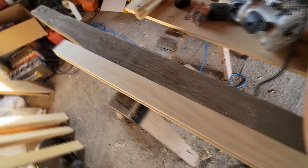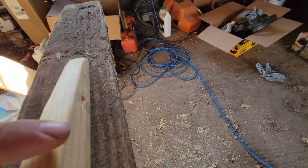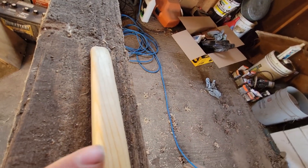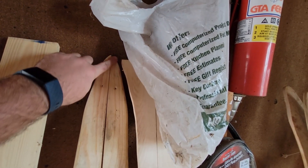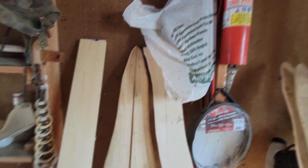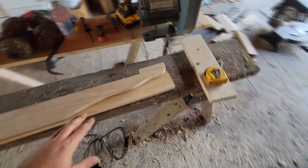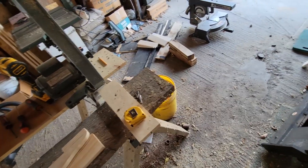I'm going to do the same thing with all the old ones I already had — router a quarter-inch roundover on both the top and bottom all the way around. Here's a coyote board I already have done but haven't put back together. I took the quarter-inch router bit and rounded both edges — you can see what it looks like on the end. I had both halves lined up sitting on my table and routered right around the end continuously so both corners line up with the same radius.